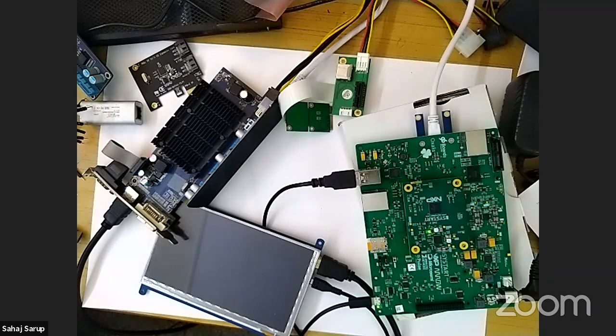The graphic card is connected to the Oxalis board. So what I'll do is boot the board, which will take a few seconds because it's loading around 280 megabytes of RAM disk essentially onto the RAM. So I'm not directly running Debian on it. It's a Yocto build right now, which I am planning to move to a proper Debian build. If everything goes to plan, you should see a cursor appear. The display just activated, and there we go.